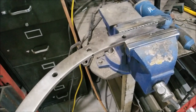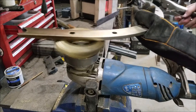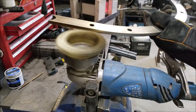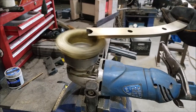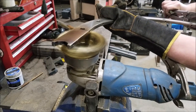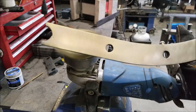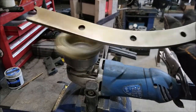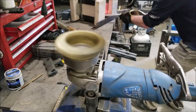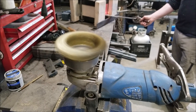Propane forge time. So you can tell when the metal reaches exactly the right temperature, the brass will kind of flow right onto the surface quite easily, and there's a lot more drag, and you can feel the moment when it starts to be applied. So the trick is to keep heating up the steel and adding layers without getting it too hot in the forge and burning off the layer you already put on.